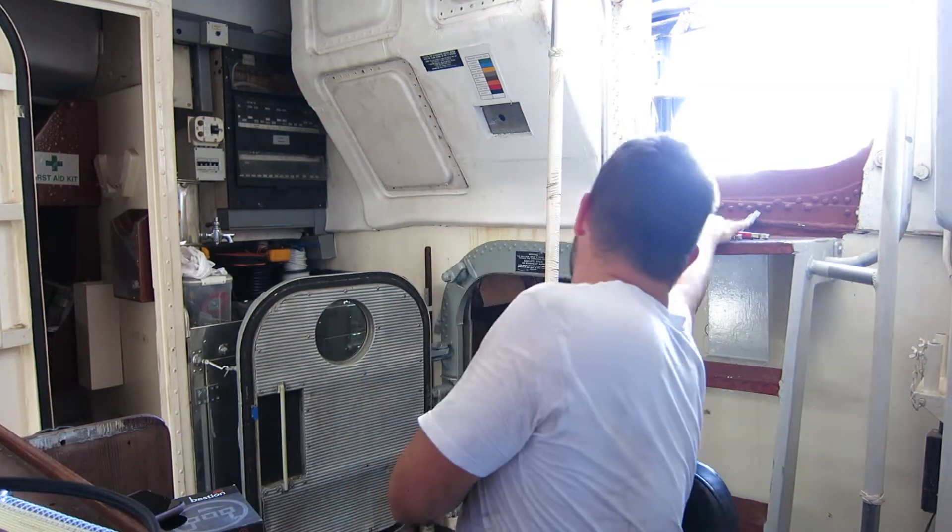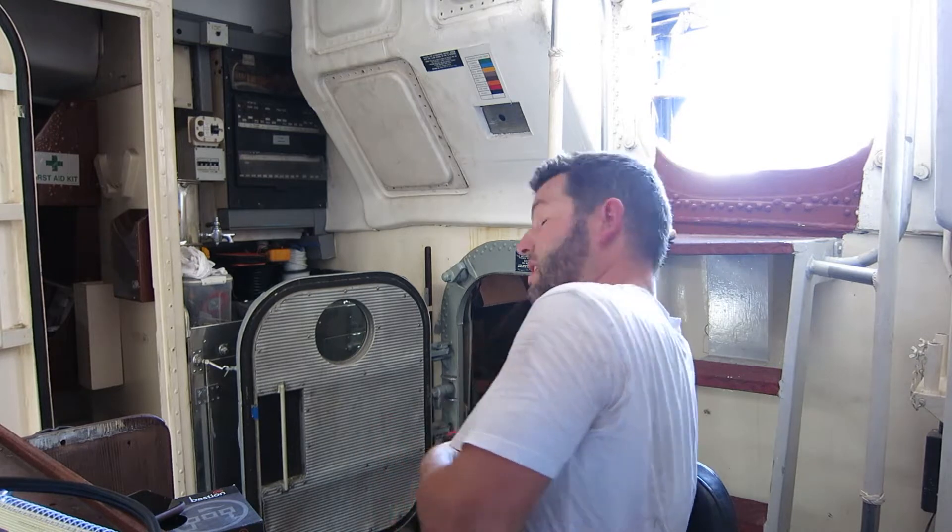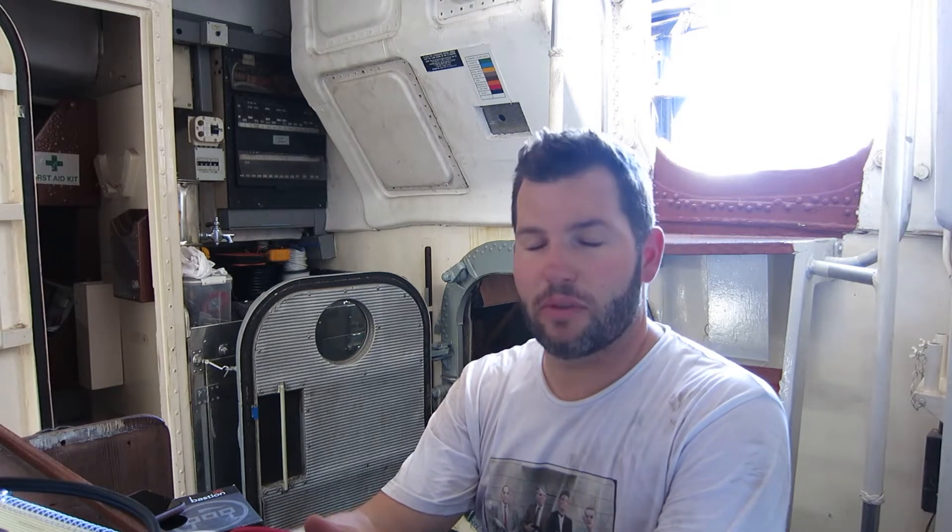Alright, so one of my next jobs is to wire up a very basic solar system. We've got two 18 volt panels that both have an output of about 13 amps each, so we're going to run them in series to pump up the voltage to 36 volts.